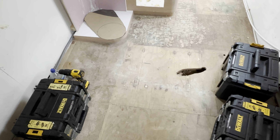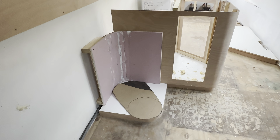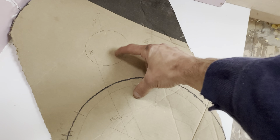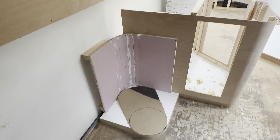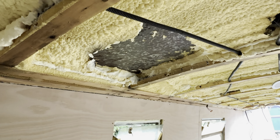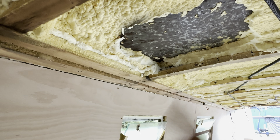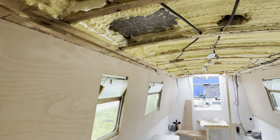Some of their kit's already in, they've gone back to get some more. We've just had a little look at the fireplace and the hearth install - Paul said it's fine. He's also said that the distance between the flue and the stove has been reduced slightly, which is good because it means they've got a bit more room to play with. The flue can be quite easily disconnected from the stove and from the roof collar, so I can remove it, put my boards in, put the trim back up and I won't have to have a split through it, which is really good news.